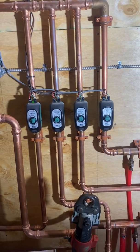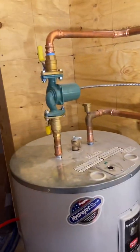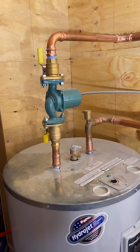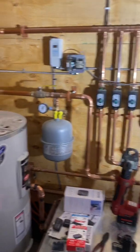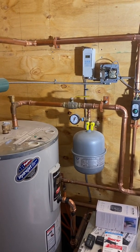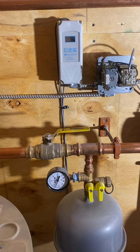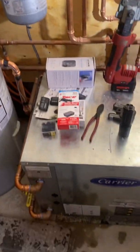There are four different zones — one is the garage and three are for the house. When any of these zone valves call for heat via the thermostat, there's an end switch on them that activates the circulator pump. The heat pump maintains the temperature of the tank. If zones come on and the tank temperature starts to drop, there's a large differential set on that Ranco control to minimize cycle rates on the Carrier unit — set for 105 degrees with a 15-degree differential, so it drops to about 90 before the heat pump kicks back on.